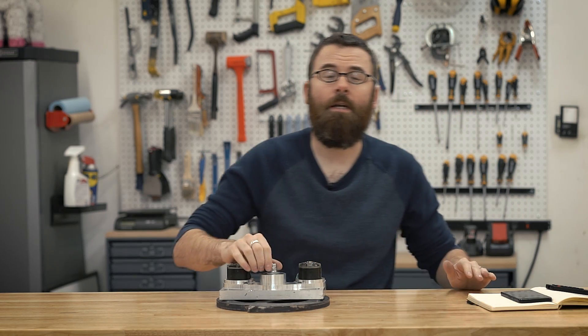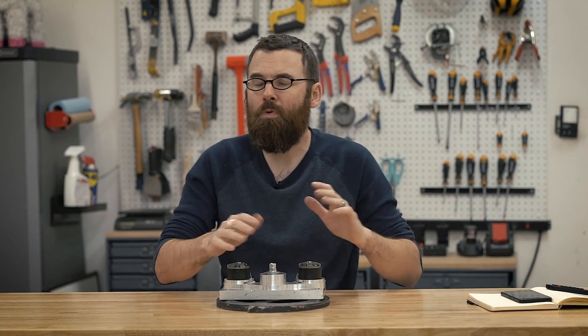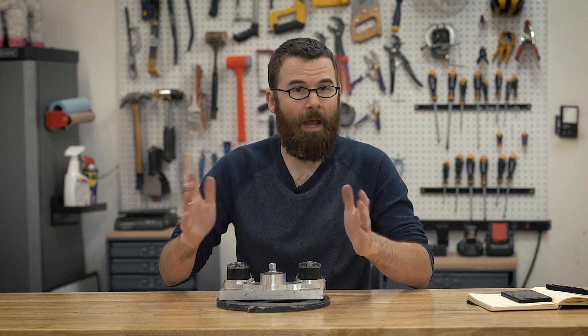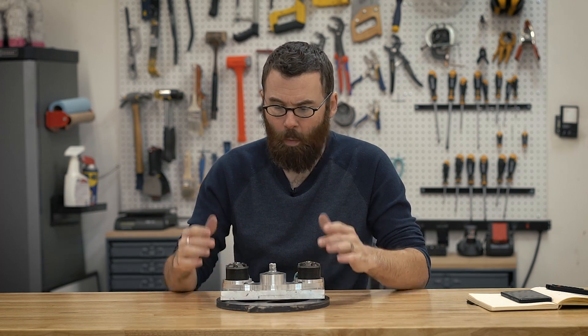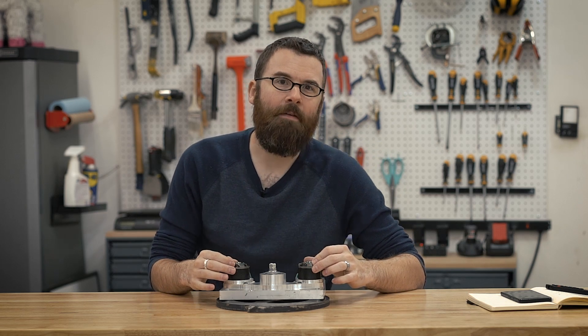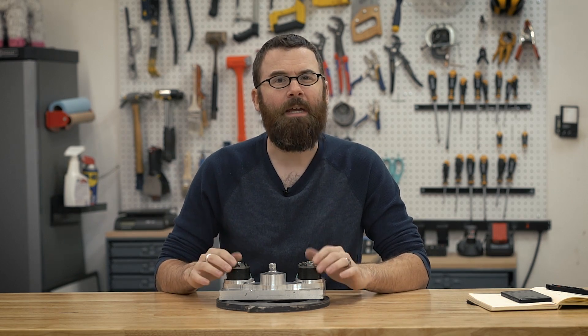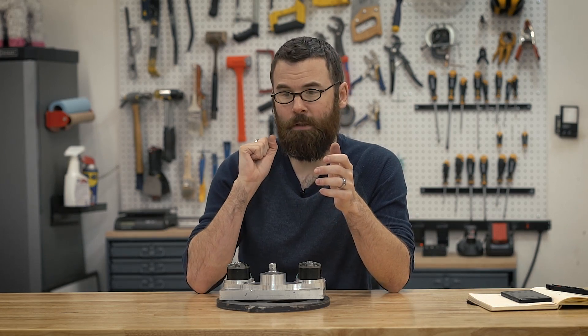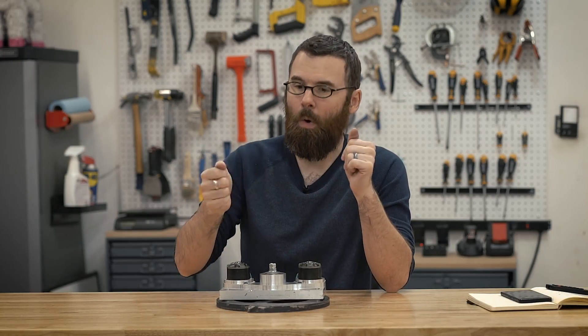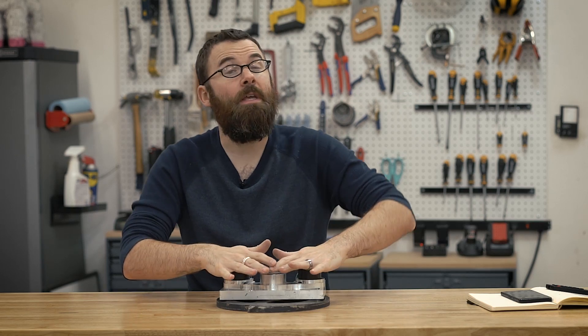With mine, I calculated a total spin-up time of about two and a half to three seconds. I did have some belt slipping, which I actually accounted for — I wanted that belt slip. So I'd say it's probably closer to about five seconds total, but within that first second it's actually really good. In initial testing, if I just punch it forward on the throttle, I get some belt squeal and slip. But generally, if I feather it up, I can go up pretty quickly without issue.